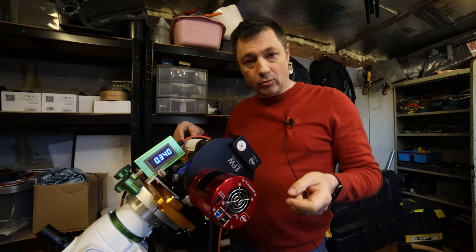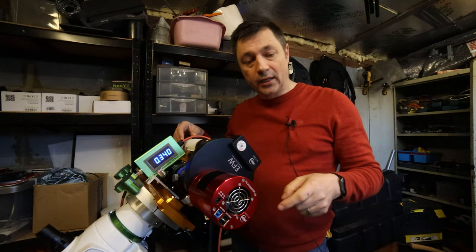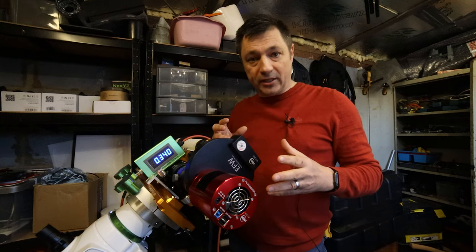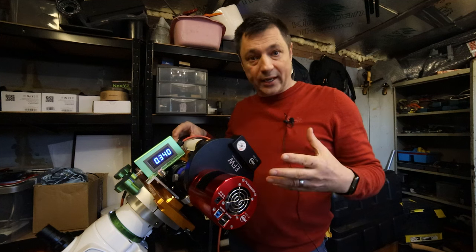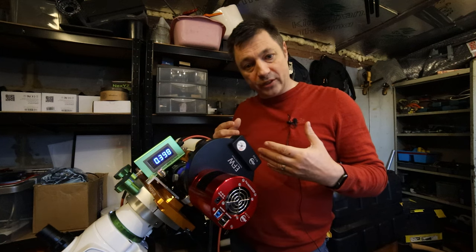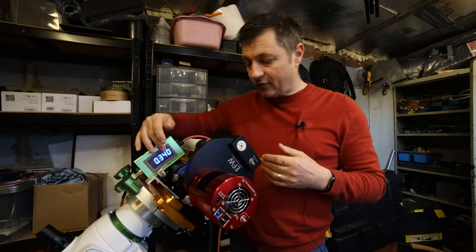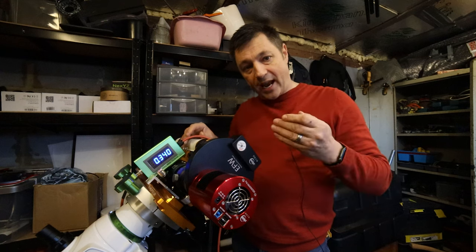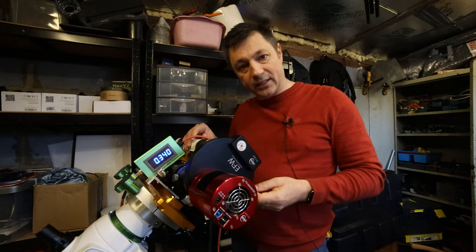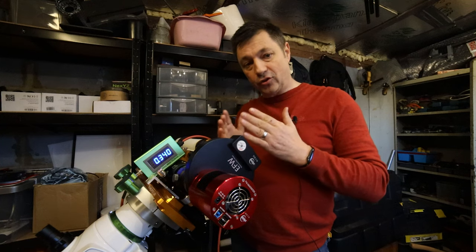What you can end up with is a binding that is actually audible - the mount actually freezes and makes a grinding noise. That means the worm drive is too tight - that's extreme binding between the gears and that's no good whatsoever. You must immediately back everything off until it's not doing that. What you want to do is move the gears in ever so slowly, and what I found with this meter is if you move them in slowly until you start getting a fluctuation in the hundreds - or it starts high and then comes back down when slewing - that's possibly very slight binding in the gears.